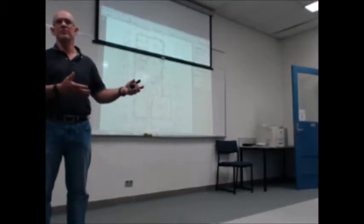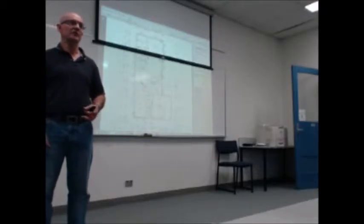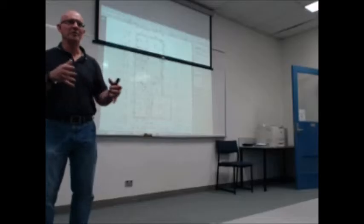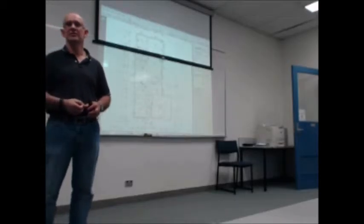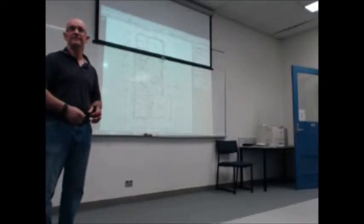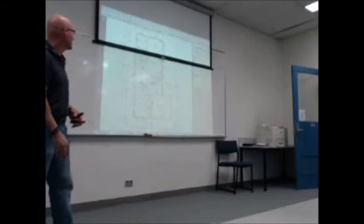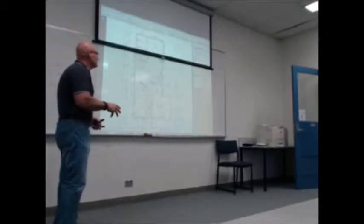Especially if I'm waiting for the kitchen, tile underneath, right? Sometimes I would just get the kicker, put the kicker in, and tile up to the kicker, so I didn't have to work in between cupboards. Usually they've drawn where the kitchen goes on the floor, and you tile over it. With the kitchen, you don't even have to go right up to the wall. You can leave the last line out. Adjust the cuts, put cuts at the back, just the packers, just so the kicker sits on. There's all little things like that. You need to be able to work out everything.